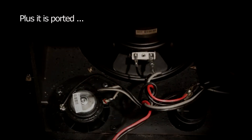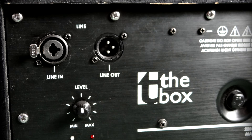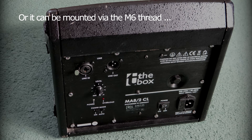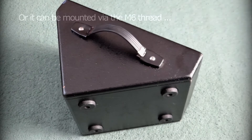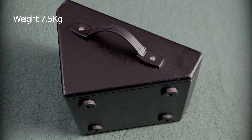This is an active monitor — power is 70 watts, equipped with an 8-inch speaker and a tweeter. The frequency range is 80 Hz to 20 kHz. The only control on the back is a volume control — no EQ. You've got an XLR/TRS combo input and a monitor XLR out so you can chain these up. It's a floor monitor, so it works like a standard wedge — great for singers or standing players, though drummers may want to raise it on a chair or box.